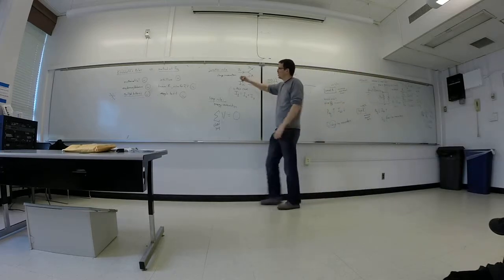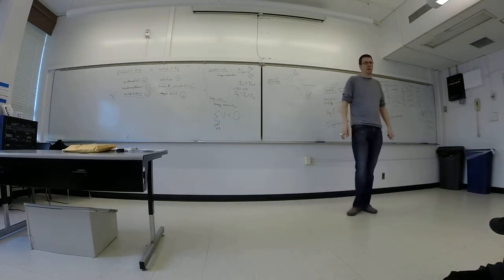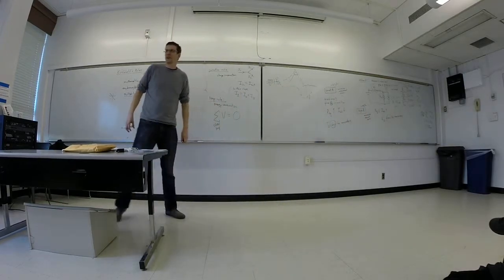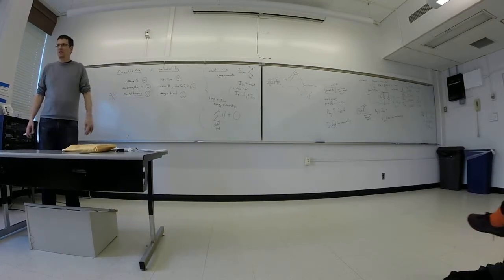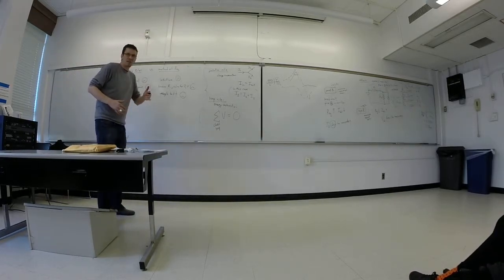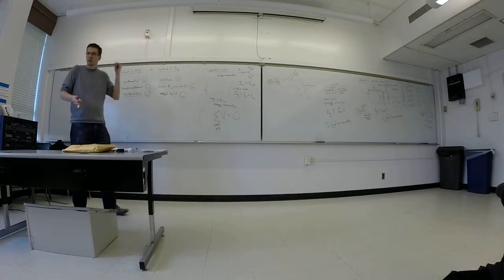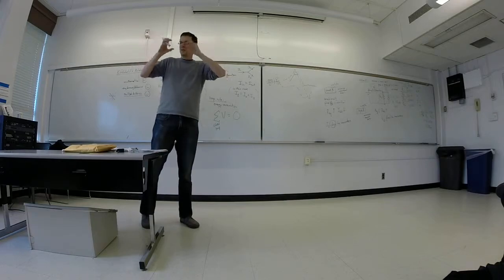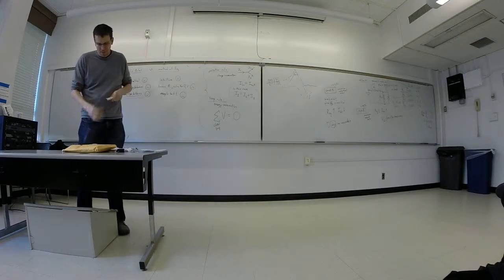So what we're going to do, just to give you a little preview, we're going to write down these equations, as many of these as we can about a circuit. Make sure that the charge is all there. Make sure that we don't have mutually contradicting voltage values at the same location. And it turns out that if you write down enough of those seemingly trivial statements, you can write down so many equations that the currents and voltages and whatever are so constrained that their values have to be that. And that's Kirchhoff's rules. Okay? So a series of trivial statements, and enough of them constrain the values enough that we now know everything we want to know about the circuit. So I'll show you how that works next time.